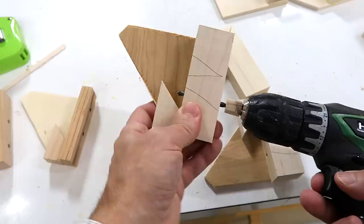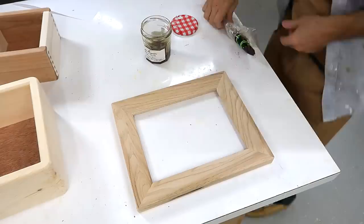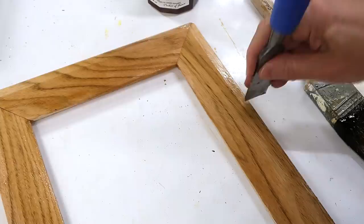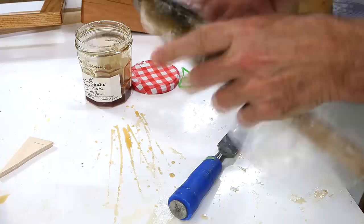So basically this one works, and then I made this one for this video. Let's see if I can pick this squeeze-out off with a pair of chisels. There are some drops of glue on there which really show up with the varnish — always got to have a chisel handy when doing that sort of thing. A trick I learned from John Heist: for oil-based varnish, don't clean the brush — just wrap it tightly in a bag and keep it in the freezer, and it'll stay good for next time.